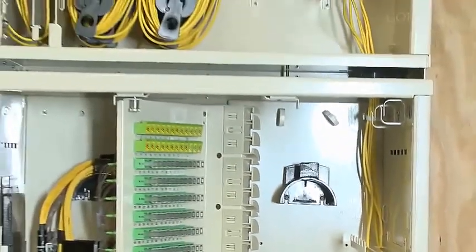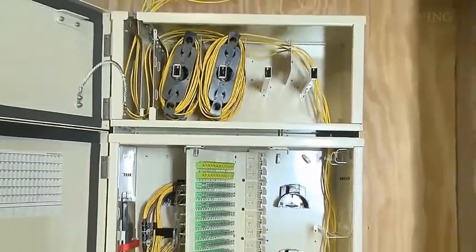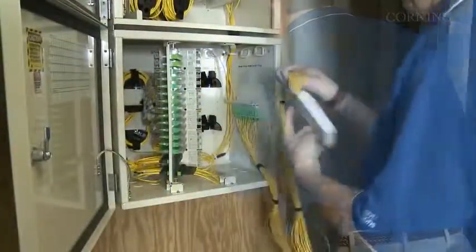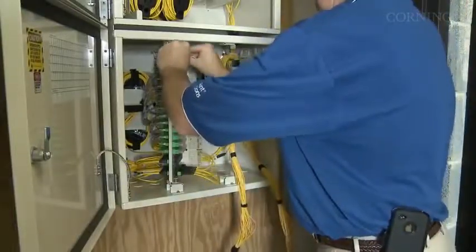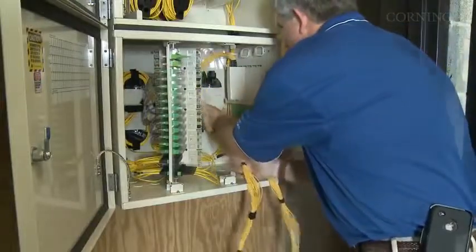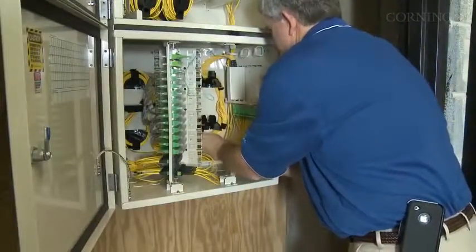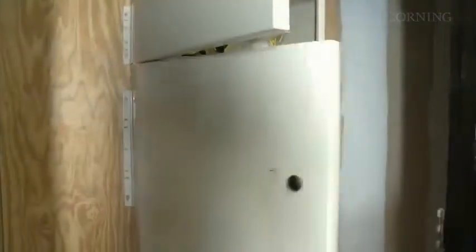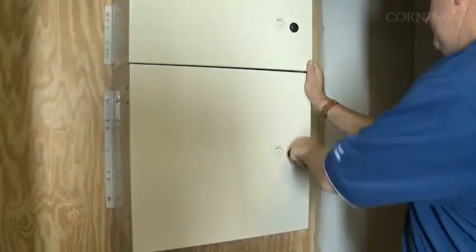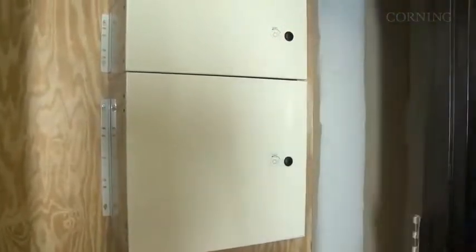Using the brackets on the right wall of the CE cabinet, begin installing the splitters which come with the connector parking feature. Once each splitter is attached to the cabinet, clean and install the SC-APC connector on the aqua cable to the desired splitter adapter in the top two rows of the patch panel. Route the splitter legs at the rear of the cabinet. The splitter legs can now be connected to the patch panel. Each SC-APC connector should be cleaned prior to mating. For additional resources, visit our website at www.corning.com.